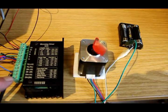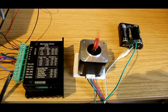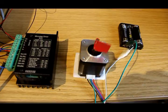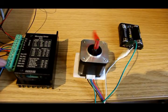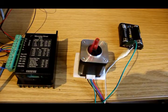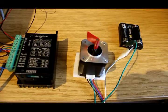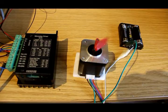That only leaves one more pair of connections to deal with, which is ENA — which means Enable. We've now transferred our 5 volt supply onto the enable pins. If I complete the circuit and apply 5 volts there, the motor stops. If I want to start it again, disconnect the 5 volts and off it goes. In my application I actually used to start and stop the motor by turning the power on and off, which is not a very elegant way of doing it, but it certainly worked.